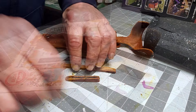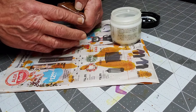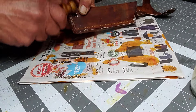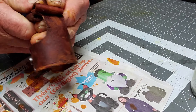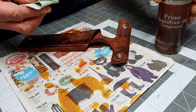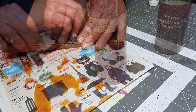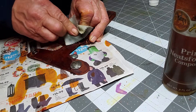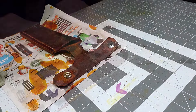Here I'm just trimming off the edges, rounding things up and that sort of thing. This video would have been an hour long - there was almost four hours of video and I had to really pick and choose to keep it at a decent length. Here I'm using that gum again - I really like this, it really finishes the leather nicely. You put it on, let it sit a couple of minutes, and then rub it in. Now I'm using prime neatsfoot oil - it keeps the leather in good condition. I use this on all my leather sheaths once a year, it stops the leather from cracking.